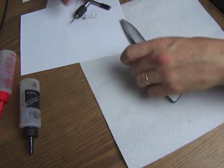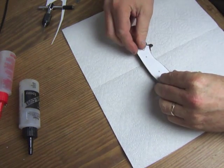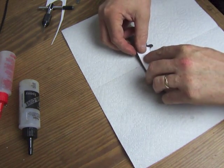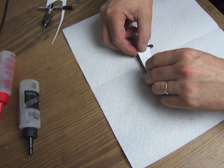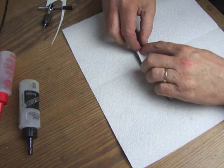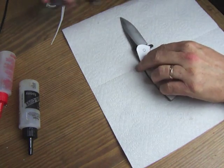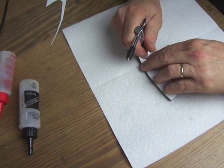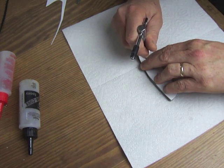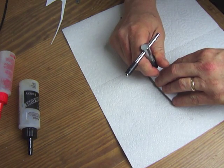While the handle scales are drying and going together, I'm going to go ahead and mark the knife with this paper pattern for where I want the holes to be — the screw holes to hold the scales on. I'm just making sure that I have it positioned right, and then I'm just going to scratch through it onto the titanium and mark it so that I can drill through there, because the scales are going to screw on with 6-32 machine screws — countersunk machine screws. I'm taking this tap, which is hard and sharp on the tip, and I'm just going to scratch through the paper and scratch a mark onto the scales.